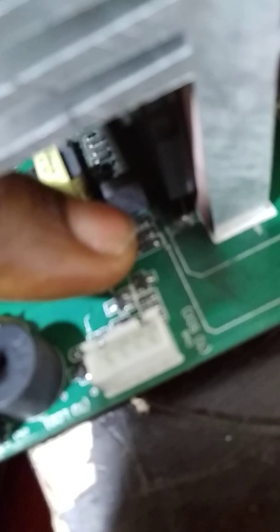If error 06 persists, please replace all the resistors lined here after these two isolator transformers. The resistors and diodes that are lined up there — you can see them, they are very tiny — replace them, and also replace the IGBTs. Replace all four IGBTs here. Once that's done, the error 06 is supposed to go. I'm very certain about that — it's something I've been doing.